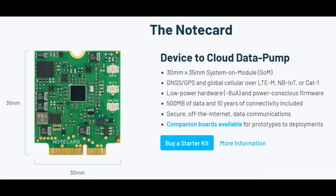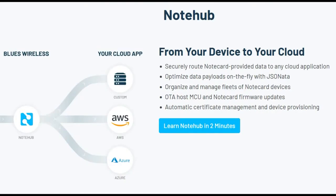We'll talk about why you might want one or the other. You have four different cards, each with a slightly different amount of support. You plug it into your dev board or their dev board, connect to their cloud, and the cloud redirects the data from your device into AWS or your cloud app. Everything's done with JSON data — underneath you can do HTTP, CoAP, or MQTT. 500 megabytes isn't a lot for a regular data plan, but if you're transmitting temperature data, motion activity, or GPS, it'll last you quite a while.